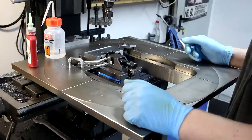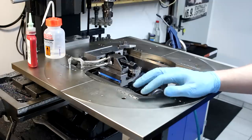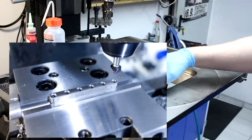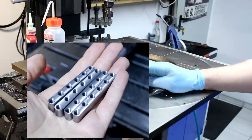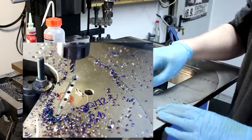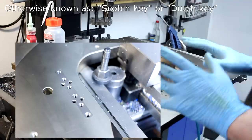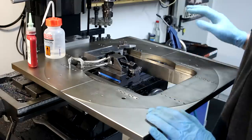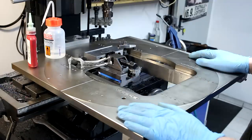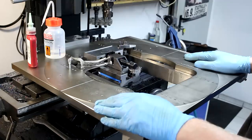So I was asked to do something. I decided to not use solid thread repair inserts or helicoils, but machine solid inserts like a large key with M5 threads in them out of tool steel, machine a pocket in here, glue them in with Loctite 648, and use some tangential M4 set screws to hold these keys definitely in place so they cannot fall out. Very uncommon because the part is very large for what I do usually, but it kind of worked out quite nicely.